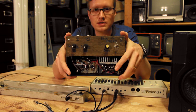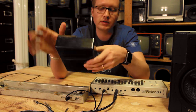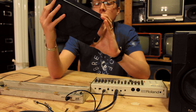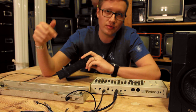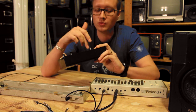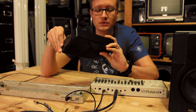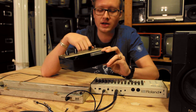The basics I got for this circuit — I actually found a schematic in Tape Op magazine. I've got the link to that in the description below if you want to check it out. I've modified it in a different way, so it's not exactly following that same schematic, but it's generally the same approach. I'm using my TR09 as my signal source — it's got some nice claps and stuff that'll work really well for this. The signal goes into a power amplifier, which is what actually drives the spring to send audio through it. This is a 15 watt power amplifier left over from a kit from one of my students, so I decided to hack it and implement it into this setup — totally way more power than it needs, but it works pretty well.